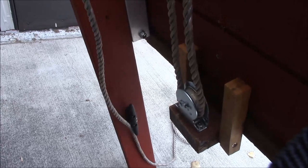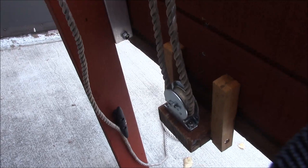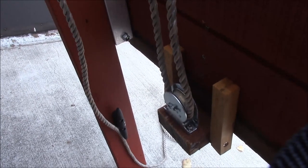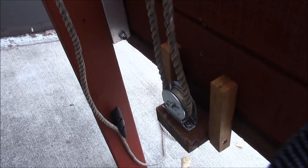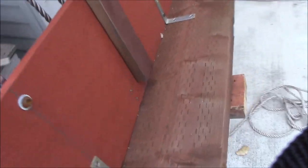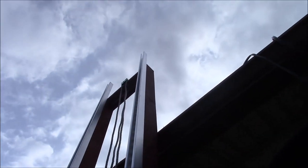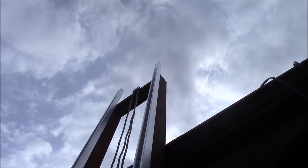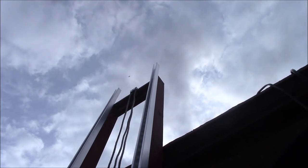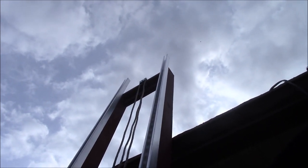At the bottom I have the rope and there's a cleat, so I've got a two-to-one mechanical advantage. I have to pull about twice as much rope as the platform lifts. I have a 50-foot rope, and I extended the unistrut a foot or so past the top of the frame, mainly so I could have it up high enough that it was easy to lift panels off.